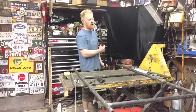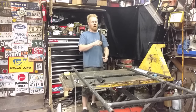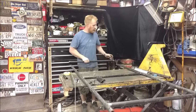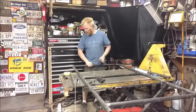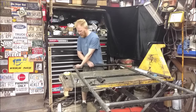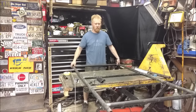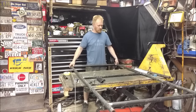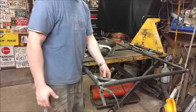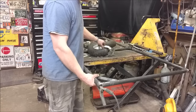The hardest part about doing pipe is you don't have to notch it, but I notched it. Go watch the video on how to notch if you're curious — I'll put a link below in the description. You can just butt weld it; it's just prettier to notch it, but most of the time I just butt and weld. I figured I'd show you guys how I notch it. So now I just got a cross member that I notched, and I'll just weld that in to brace everything up and keep it square.